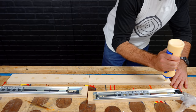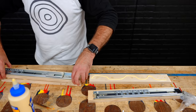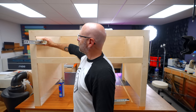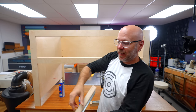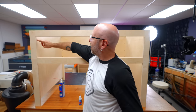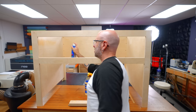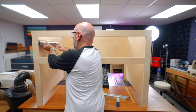Using a little bit of CA glue and a little bit of wood glue on the build-out I made. I'm going to glue these two pieces together — the CA glue is going to grab almost instantly and will act as a clamp while the wood glue dries. I got the build-out all built, now I'm just going to glue and screw it to the side. The CA glue is just going to hold it in place until I get some screws in. I've got a line drawn on here so I know to line this up perfectly — that way my drawer slides will be parallel.